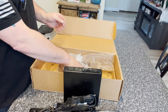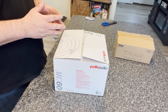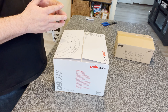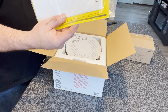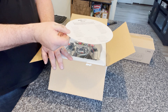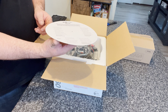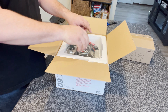There will be links in the description to this video for all of this equipment. In our experience, the best speakers for an interior location such as a bar or restaurant are the Polk Audio MC60 ceiling mount speakers. Unboxing this — it comes with instructions and a template. This template is what you use to trace on your ceiling with a pencil; you'll have to cut that out. I use a Sawzall, but you do have to cut a hole in the ceiling for the speaker to mount. It's professional installation — don't throw that template away.